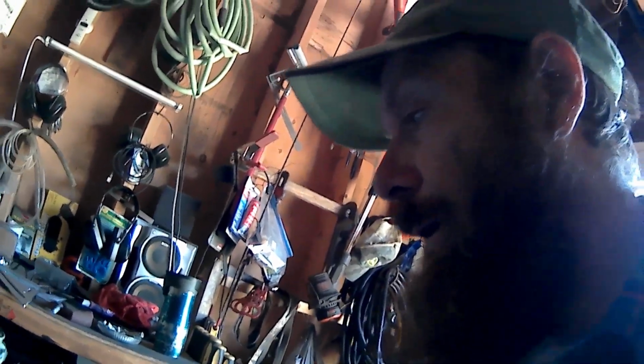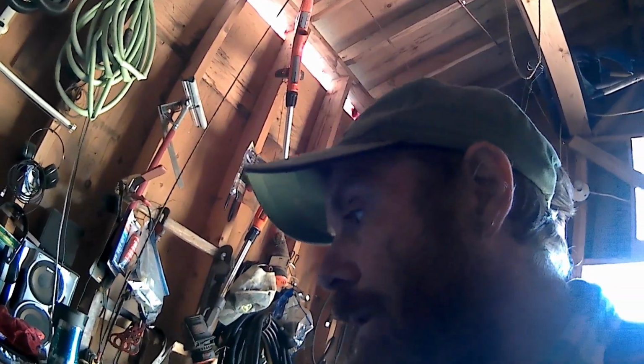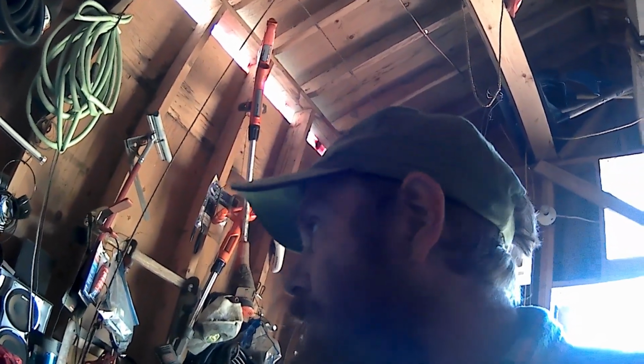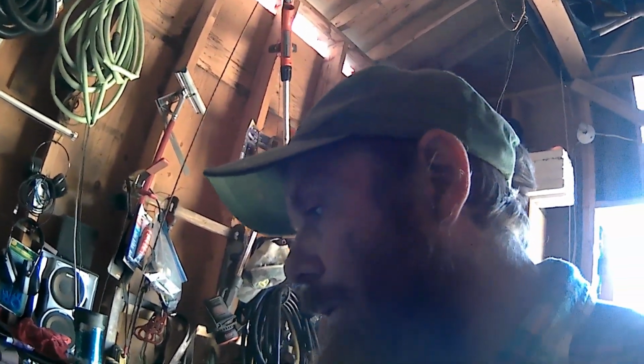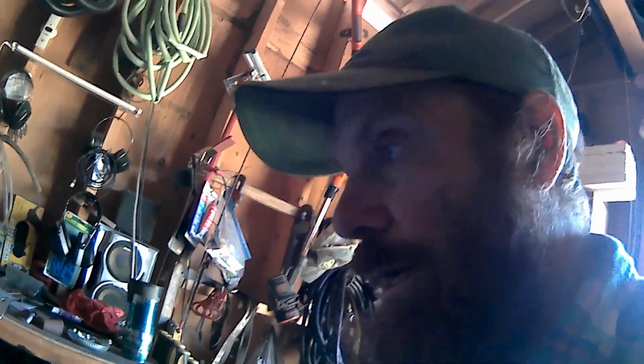So I'm going to lay this fella down. I'm going to sharpen up a nail to a nice precision point that I can use to run my lines. And then take it from there. Yeah, probably use a piece of angle iron or something like that as a straight edge. I got my framing square over there, but it's only good for 24 inches, and it's a little bit longer than that, but framing square will be needed. I'm going to clean this little fella up just a smidge, and yeah, we're going to take it from there.